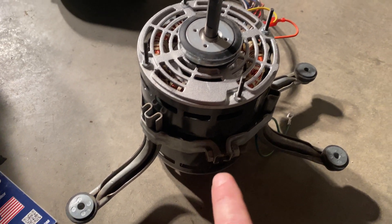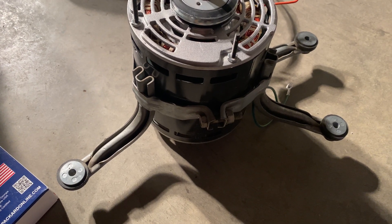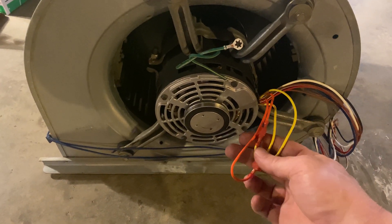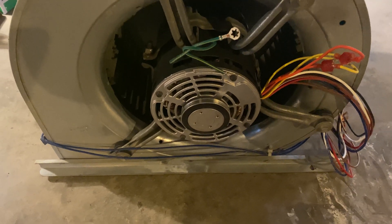Got the frame off the old motor and got the new motor on. All I've got to do now is put it back in and wire up the new board and we'll be good to go. That only took a few minutes — new motor mounted back in the squirrel cage. The only thing I had to do was change these wires for clockwise rotation, because the motor came with counterclockwise. This is not hard at all — pretty easy. I'm spending most of my time running up and down the stairs to the garage getting different tools, but other than that things are going really smooth.